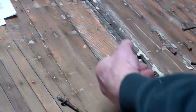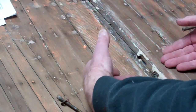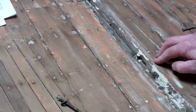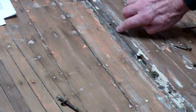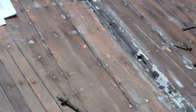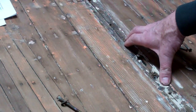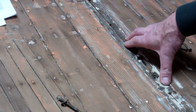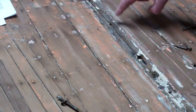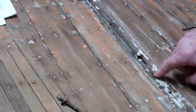The problem though is that since this was not sealed in any way on the outer side of the keel where the keel meets the garboard, leaving all of this open is a recipe for water flooding in, rot starting at some point. So we will treat this much the same way we treat the final planking installation on a true 5200 bottom. This seam all the way up will be filled right to the top with 5200.